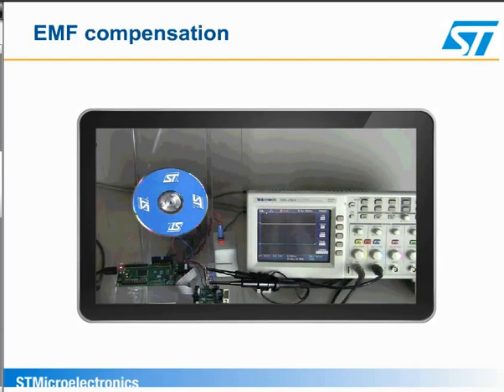If we now set the registers in the L6470 to compensate for the back EMF, we should see that the current is approximately constant over the speed range. These are values that we've empirically determined are the correct slope to compensate for the back EMF. Again, we trigger the scope at the start of a movement. We see that the back EMF compensation has increased the applied voltage as speed increases, and the peak current remains approximately constant over the speed range. We could even overcompensate and have the current increase with speed by setting the slope higher.